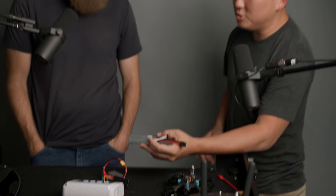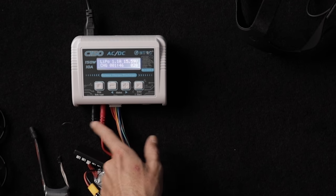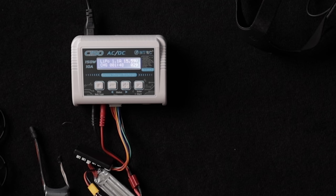How do people mess this up? You could plug these into the wrong connector — you don't want to reverse the polarity or you'll short something. Robert has never had a battery explode, but he's had batteries puff up from flying them too hard — like going full throttle aggressively. They can also explode if punctured in a crash. It kind of just sounds like a soda can letting the fizz out, and then it'll catch on fire. It's not going to go boom and explode.